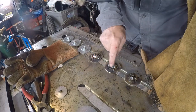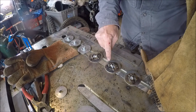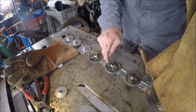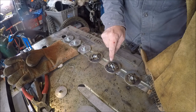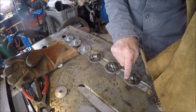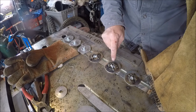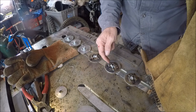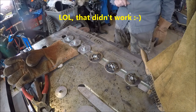I don't care what this looks like - it doesn't have to look good. I'm trying to leave a little bit of space so I can drill holes and still leave room for the screw heads to fit without having to grind anything out. I'm leaving a space here and a space here, like I did on this finished one. Also, if you just start welding on one side it'll warp, so I'm tacking one side, then quickly tacking the other side to keep it level - same with the nut. Tack one side, tack the other, keep it level. I really don't want these crooked.